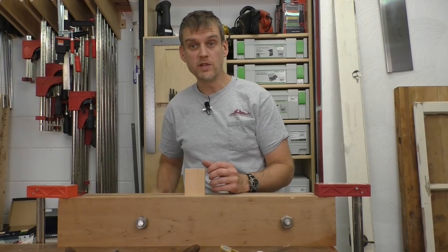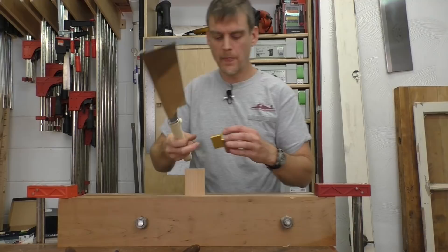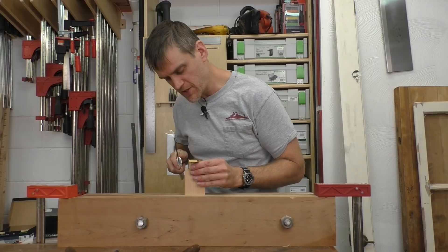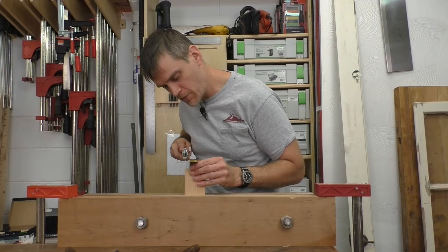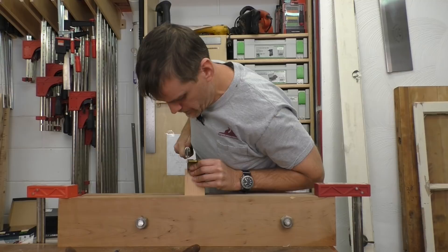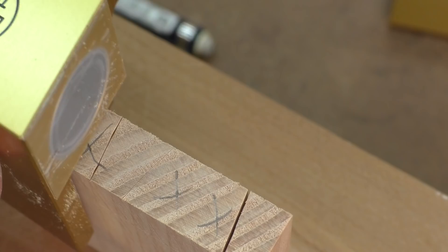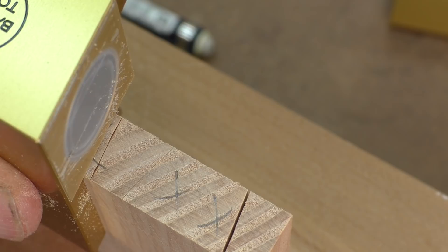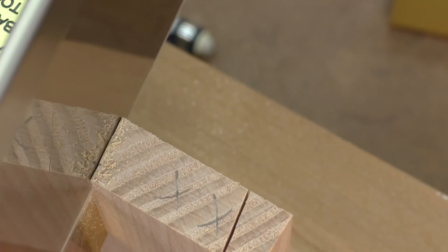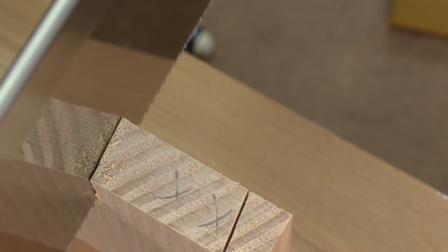Grab my 1-in-6 again — the exact same guide I was just using. This time I am going to flip it around to get the correct angle. The guide goes on top so the magnet is above the workpiece. Line it up so that my saw is cutting on the waste side of my marking line — just snug right up to that marking line on the waste side — and let the magnet guide the saw all the way down to my line. Move it over, make sure the angle is lining up correctly, again on the waste side, and cut to the waste side at the correct angle with the saw straight up and down, down to my marked line.